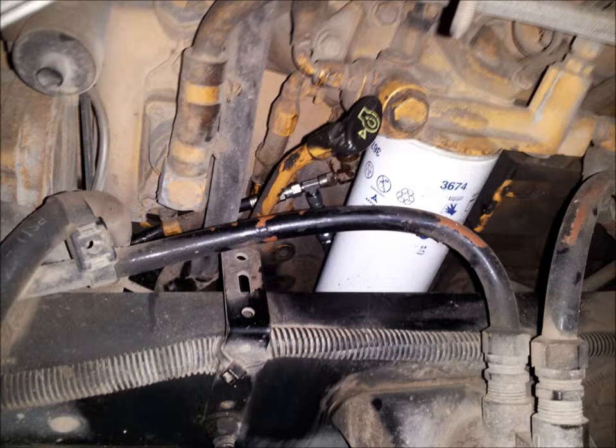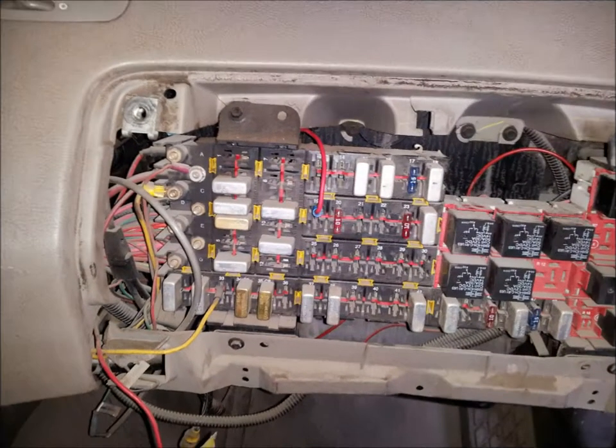At the engine oil pressure sensor, disconnect the hydraulic hose and install the JIC oil pressure switch adapter T provided and orient the side port downward as shown. These are all JIC connections and do not require thread sealant. Install the JIC end of the pressure hose assembly to the side port of the oil pressure switch adapter T just installed. Now it's time to power the thermal dehydrator.